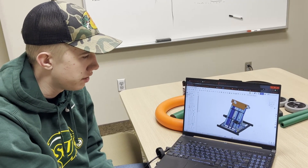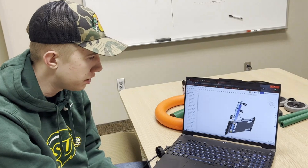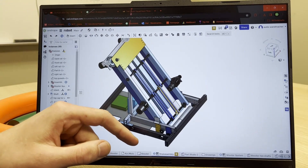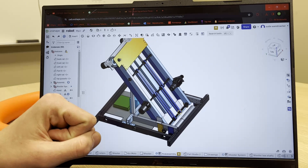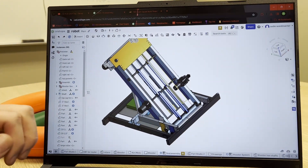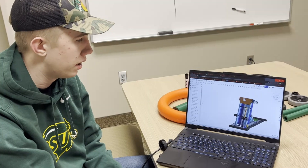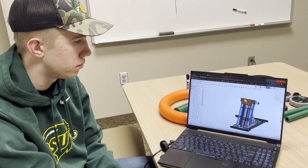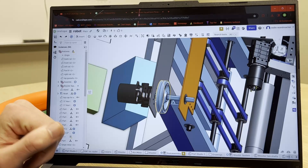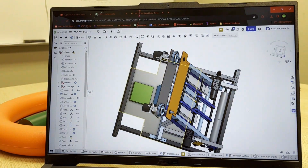So this is our CAD model — we've got some stuff hidden just so it's easier to see our main manipulator. With our intake under here, it's going to come under our bumpers into this front roller that's going to pull it up further into our robot, with a secondary roller to help assist it in. Then that's going to feed it into a system of pulleys and belts to drag it up what we're calling our storage elevator. Once we have a note picked up and stored, it will then come into our flywheel shooter, which we have about two inches of compression on right now, with a little bit of adjustability so we can play around with that later.